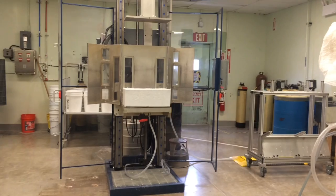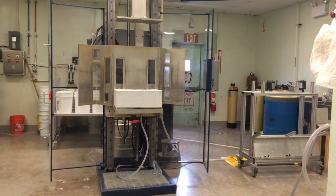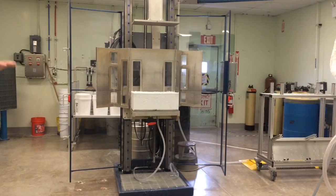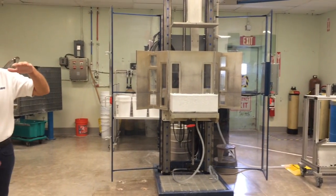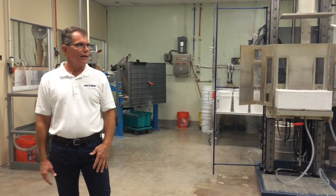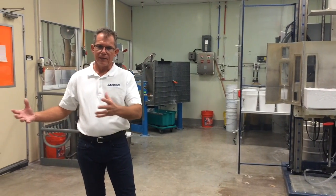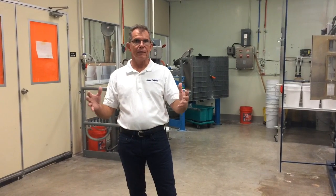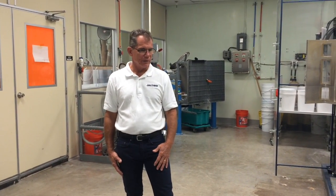The material goes in, then we pull the water out of it and start building the felt. Then we cap the tower and run a ram to actually press the material down to a specific volume. That allows us to know — we calculated a certain amount of mass to go into that volume — and have an estimated dry density, or starting density, that we're looking for.